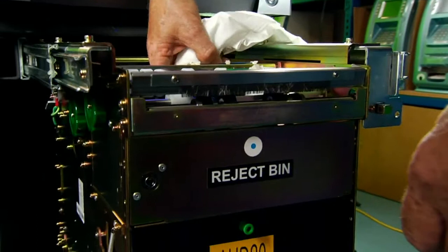The motorised cash canisters come in two configurations: 1,000 note and 2,000 note capacity. The canisters are made from high grade steel, as opposed to inferior brittle plastic. The dispenser is also motorised, enabling the ATM to dispense 5 notes per second. The overall design of the dispenser is very modular, with easy access for removing obstructions and belt replacement if required. The reject bin can hold up to 40 notes before resetting is required.